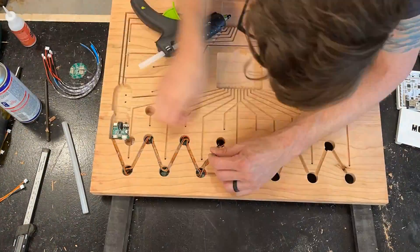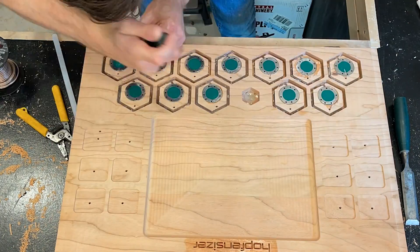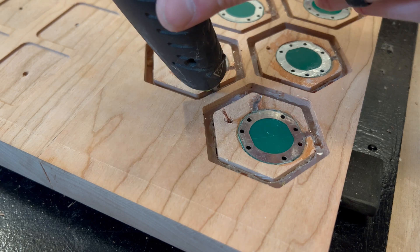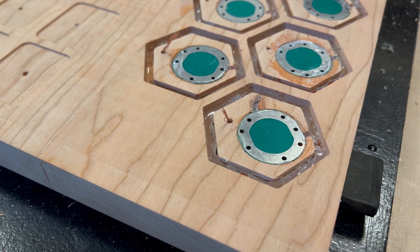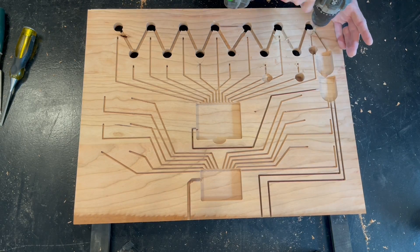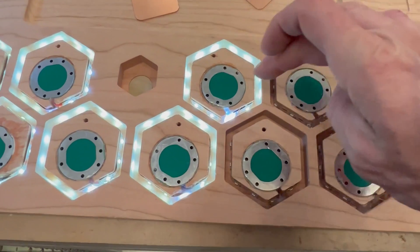Because I needed open space in those cavities between the top and the bottom to run wires, I needed to seal up the gaps to prevent epoxy from seeping through and damaging the electronics. Hot glue is perfect for that — it's easy to use, dries fast, and it's non-conductive. So I squirted hot glue into the bottom of the light cavities to cover up the LED strips, shielding them from the epoxy and closing up any remaining openings for the wiring. It also cut the amount of epoxy I needed to pour in half. At the ends of each wiring channel, I drilled a small hole to feed the wire through from the bottom to the top — then I tested the lights. Yahtzee.